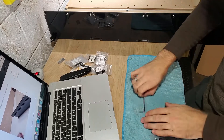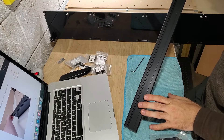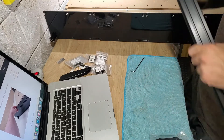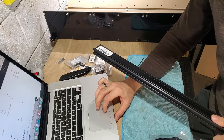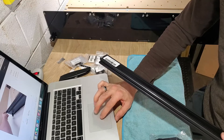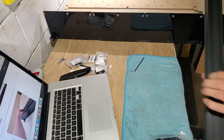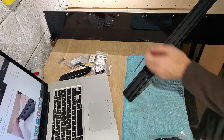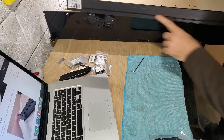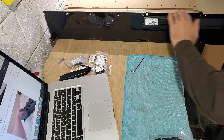I found another quirk about the new X-Carve directions. We got these large side rails — there's two sides: one with a single slot and one with a double slot. These parts are 26049-02 and we got two of them. The double slot goes towards the inside of the maker space, and the single slot goes on the outside towards the bottom. So: double slot inside, single slot on the bottom, and it's going to run in parallel with the top.